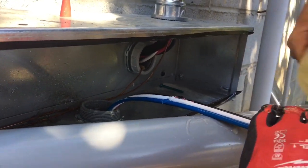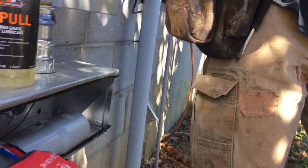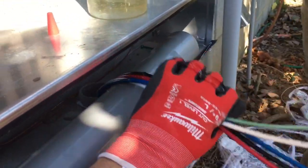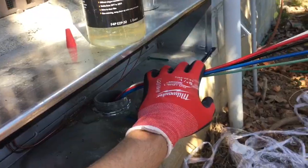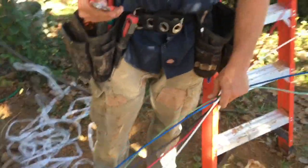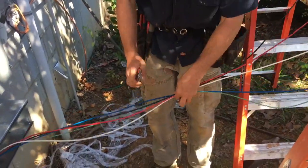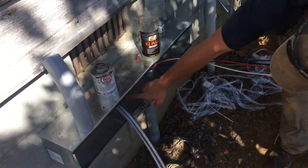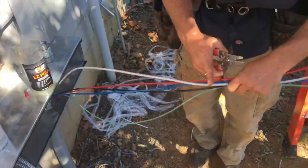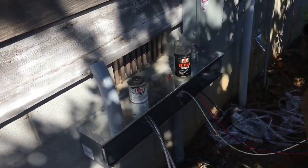Hold on — lube it up. She felt like she was sticking a little bit, so we add some lube. Turn your glove over to the bottom of the wire and it'll work really well. That's it for the pull — and you want to make sure you don't cut your wire off too short. These are going to the PDB right in here, so I'm going to make sure I have enough to come up at least to the other side.